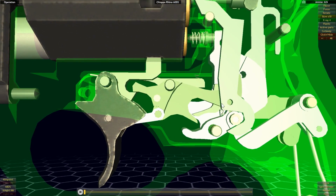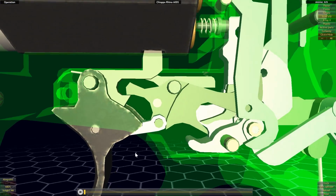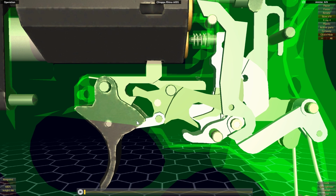Now the attachment point of the hand looks a little bit different than we've seen in the past. That's because of the trigger and this part, which I don't really know the name of. If you were to combine these two parts, in our other examples the functionality of these two parts would have been all one part, just the trigger. But now they've been separated into two parts attached by this link. The importance of this link we'll go over a little bit later in the discussion of this model. If you consider these three parts to function all together as one, you'll see that their overall functionality is the same as the one part of the trigger that we saw in our previous examples. So with that in mind, we can consider the hand to actually be attached to the trigger like in our previous examples, because overall these three parts do function together as the trigger mechanism.